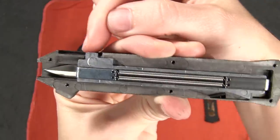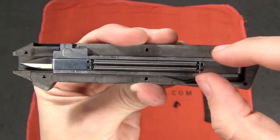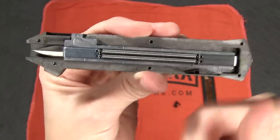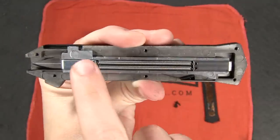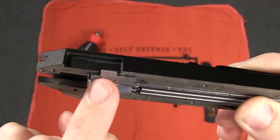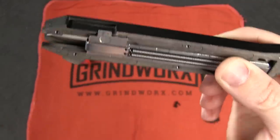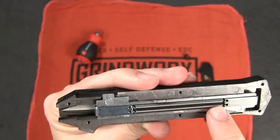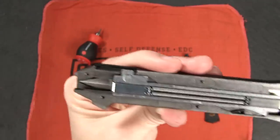But as you're moving the thumb slide this way, you're forcing this whole plate that way, which stretches the spring again in this direction. As you continue to move the plate this way, the hinge latch that I showed you on this side, through a similar process, is pushed out of the way — opened up, unlocked — which again releases the spring and allows the blade to move back into the handle.